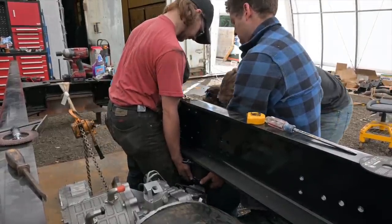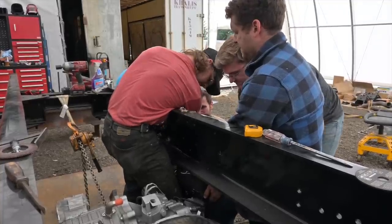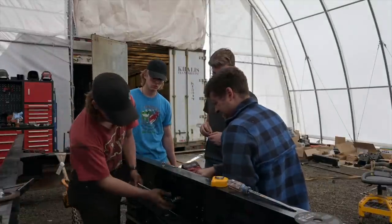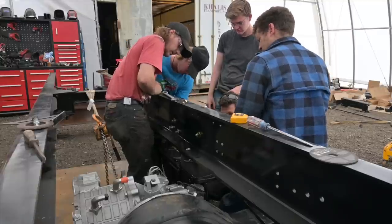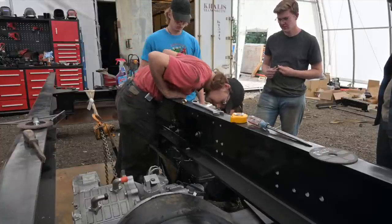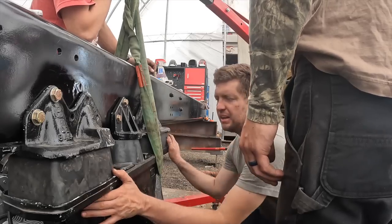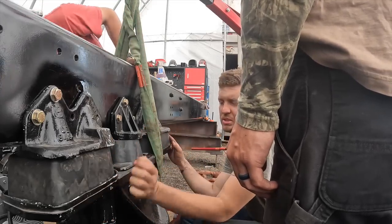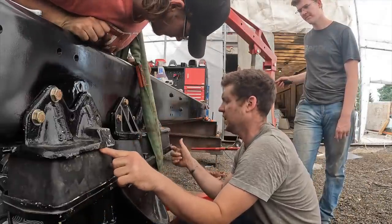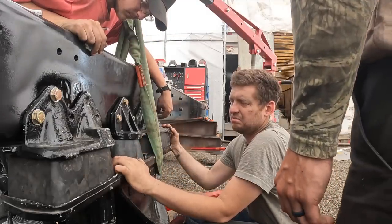The beam clips - hang this up. Zach, just find a hole, over my way just a little - oh we're almost there! I need a 15/16s wrench - thank you. Who drilled these? We had this whole thing on before - did we swap sides, maybe the one side's on a different side? We've got to go up a cut here - this one's on an angle. This would have been more compressed so it would have been on an angle. There are gaps here - if this gap was closed that one inch, that'd rotate the whole thing and move those bolts into line.